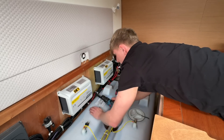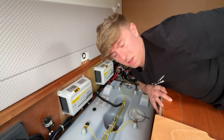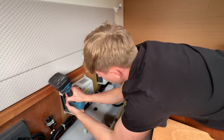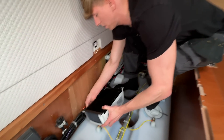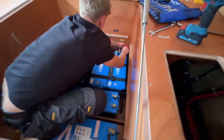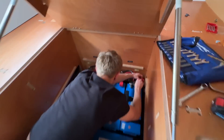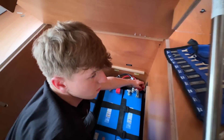The majority of the boat's electric setup is in the owner's cabin. The first thing we did was remove one of the factory-fitted chargers that the inverter was going to replace - a few simple screws and it's out. We then started working on the batteries to integrate them into the existing bank, installing them in parallel to keep everything on 12 volts.